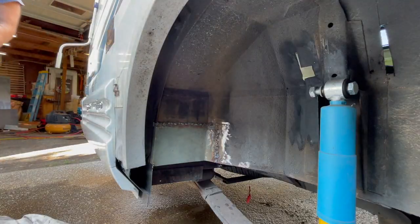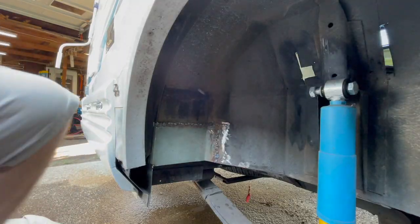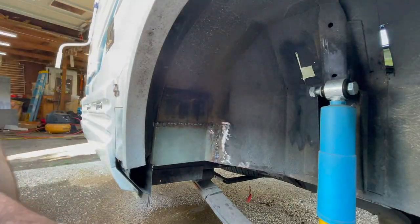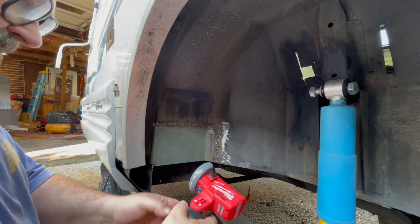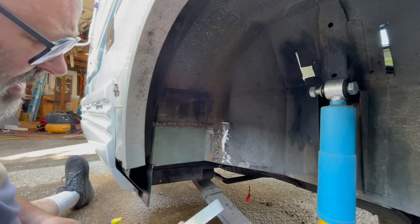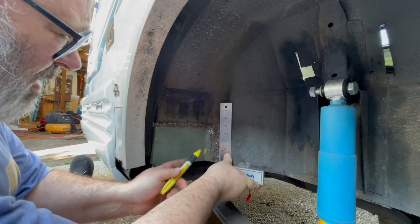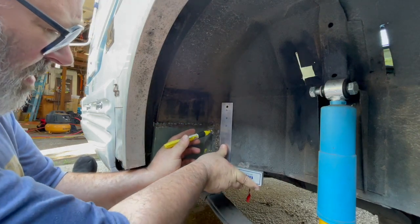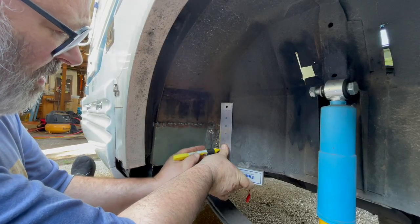So there was nothing really that I could do other than remove the piece that I had welded in yesterday. Without the gas, the welds are just so contaminated and so bad, worse than usual. There's really just no point in keeping it. But no big deal. Like I said yesterday when I was welding it, it's just metal. Metal is a lot better than wood in this respect.